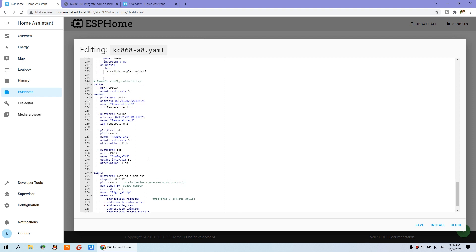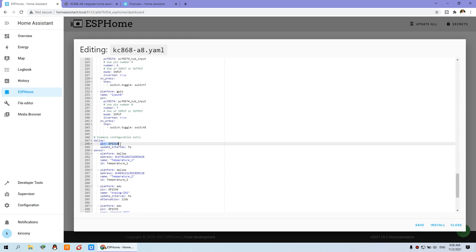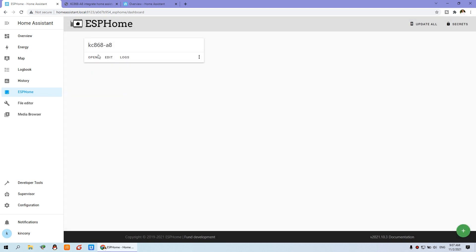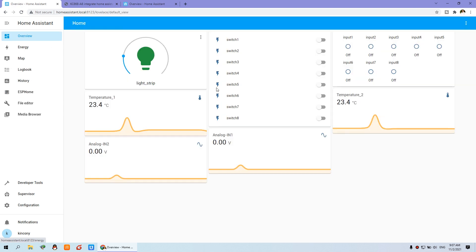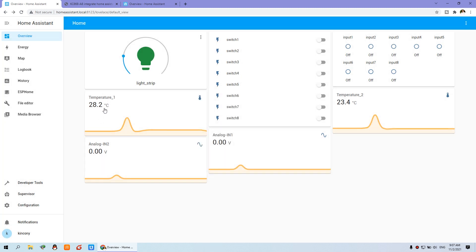All sensor data is updated periodically because you can set the temperature sensor update interval — for DS18B20, it is set to update every 5 seconds. After the download is complete, you just click Close and the device will come online. You can then add its entities to the dashboard. If I hold down one temperature sensor, you can see the temperature goes up. You can click the history card and see the changes. This is very easy — just copy and paste the configuration for ESPHome and you will see the beautiful dashboard.